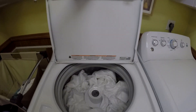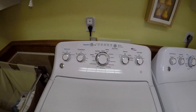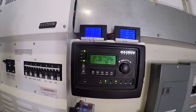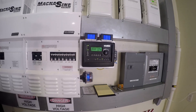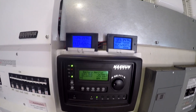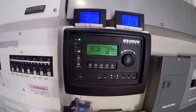Let's get some laundry started. It's about 11 o'clock — got about 8,000 or 9,000 watts coming in. I turned off a couple of the heaters because it's warming up a little. Putting 111 amps into the bank, it's 56%. Let's go turn on the water heater — this is our 240 volt water heater. Switch it to solar — see that jump. Now we're pulling 2,800 watts on L1, 3,000 on L2. The water heater has a 3,500 watt element in it, and that dropped our amps down to 39.